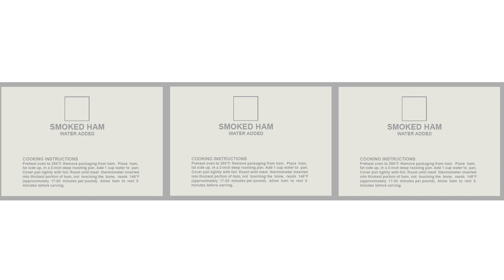If your media is not a simple rectangle, such as a circular shape, locate the sensor over the leading part of the label. If you're using media with print on the other side, try to locate the sensor away from the print so the sensor does not get a false reading.